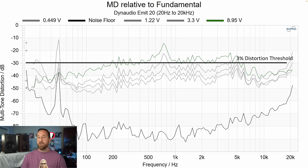The multitone distortion indicates there may not be a shorting ring used in the mid-woofer. The reason I say this is it's showing higher distortion levels in the midrange area — usually that's due to some asymmetry or absence of a shorting ring in the magnet structure to help lower inductance distortion. That's just a hunch. Also, that resonance is showing up as a spike in distortion, which may be driving those elevated midrange distortion levels. Above about 6 kilohertz, distortion drops down low, so that's not an issue. I pushed these speakers pretty hard and didn't really have any issues with audible distortion.